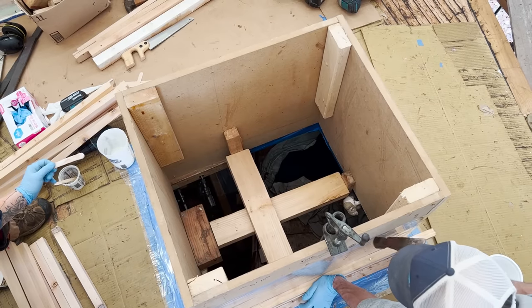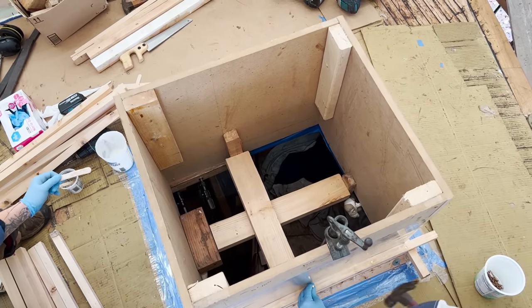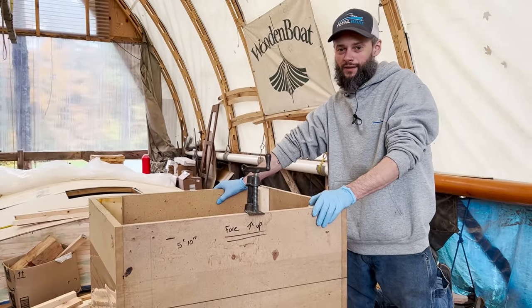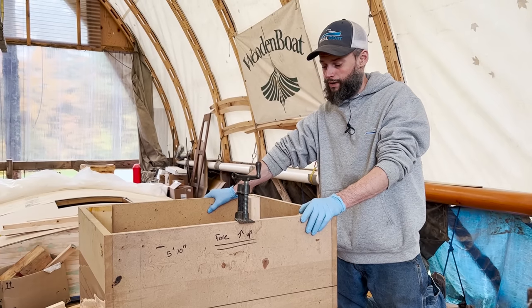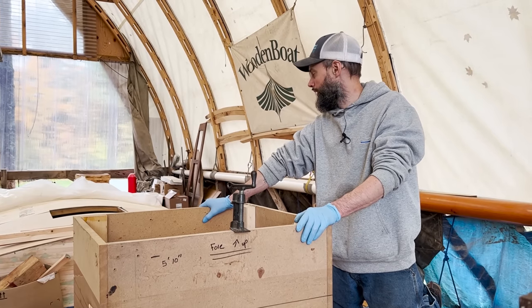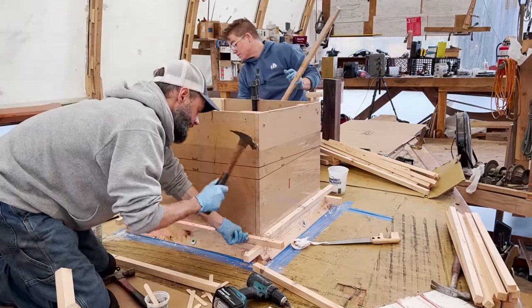So if we were to join these timbers together to be this tall, it's a lot of timber to move, and it's a very tough environment here, soaking in the rain and baking in the sun. It's a lot different than what the hull experiences. And we planked in oak, so we added a lot of weight to the hull. So if we can shave weight between the cockpit, the housetop, and the hatch, which is all up on deck, that will make a pretty big difference.